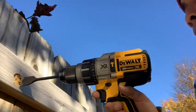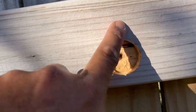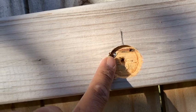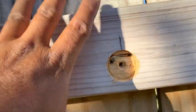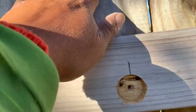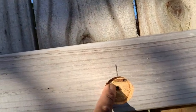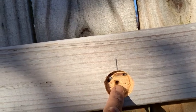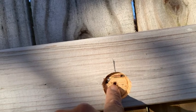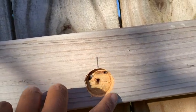As I'm boring the hole right at my mid mark, the light is still going to land around this area but it'll be covered. Now what happens sometimes is when they placed the pickets on this already-built fence, that nail over there can be in the way. If that happens, what I did with my last light is I made another hole that's a little bit further away, so that's the center mark for this entire hole, and then it'll be just a little bit wider.